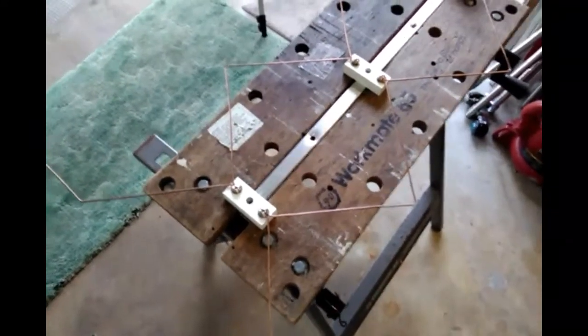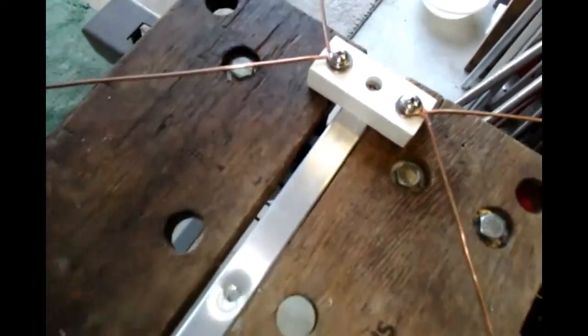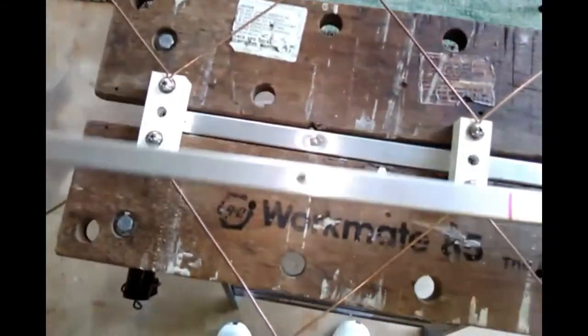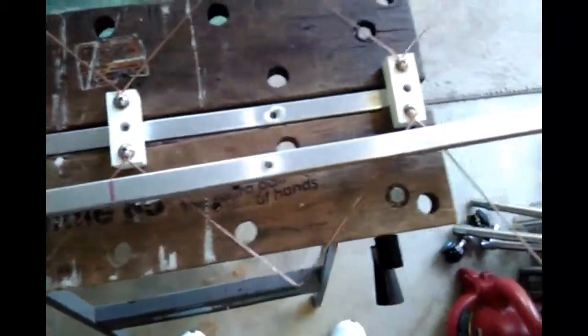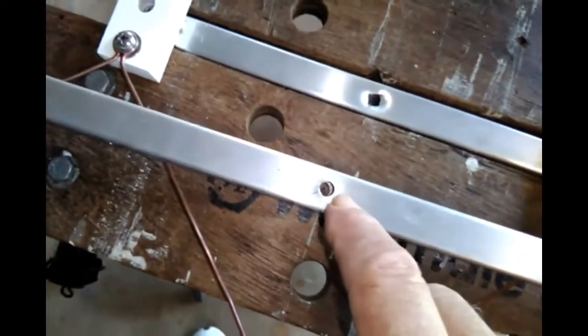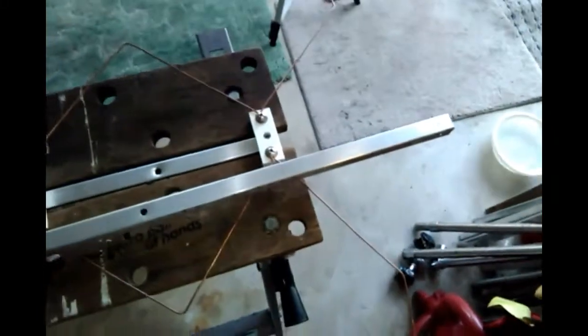We set this aside. Here's the gray Hoverman I've been working on through this video — we built that, built the backbone, drilled the holes, made the insulators. This is the backbone for the reflector. I've made two small indentations and measured where it's going to be mounted, so I can put two screws and wide washers to hold the screen there. The back of the bolts will hold the mesh or screen on. Now I need to drill a little bit, then I'll show you how to put it together.